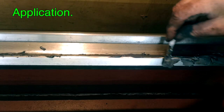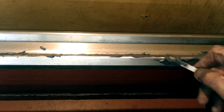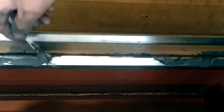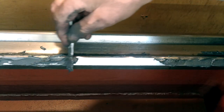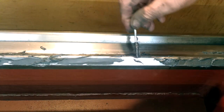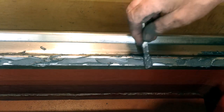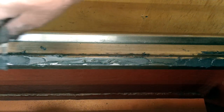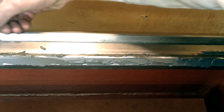Laying the resin mix onto the V-ways was only hampered by the small and inadequate size of the spatula. Working the mix was a bit like laying a very grainy body filler. The mix did its best to stick to absolutely anything it touched. I was somehow certain at this point that I was going to end up scraping off a lot more than I'd bargained for.